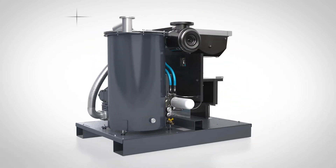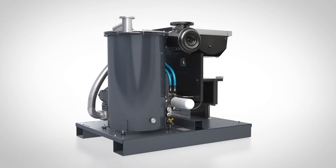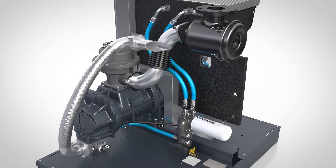The other side of the pump is the hot part. It's kept at just the right thermal conditions by regulating the temperature of the oil. That is our yang area. The thermostat decides either to send oil directly into the element or send it to the cooler first. The oil is diverted to the cooler only when needed.